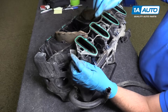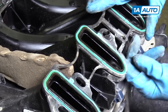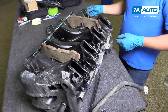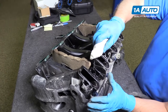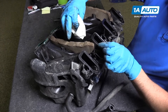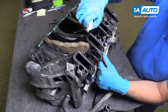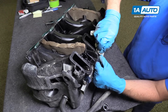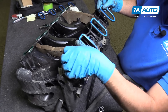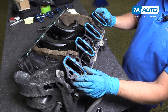We're going to replace the gaskets when we reinstall this one. To replace the gasket, there's a little lock right here — I'm going to pull that off, and then one on the end — that just holds the gasket. Before I put the new one on, I'm going to take a rag and just wipe down this area — there's a little bit of dirt and debris in there. These little insulation things go right here — these try to keep rodents out, but mice still get in there. So we'll wipe these down, take our new gasket and slide it on that side, then slide it to that lock and that lock just like that. We'll do the same for the other side.